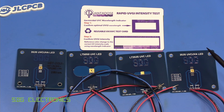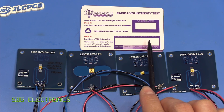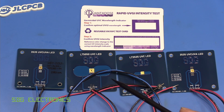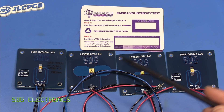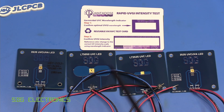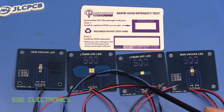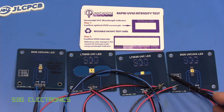Overall, all of these LEDs do actually emit germicidal UVC light, so you could use them for sterilization purposes. The higher current devices produce more UVC light. If you can see the word ultraviolet within three seconds, these LEDs emit more than 300 microwatts per centimetre squared at that distance, which is enough to kill bacteria, germs, and viruses within a very short period of time. However, as we saw, these are only about 2% efficient from electrical power to ultraviolet light — nowhere near as good as a standard discharge tube. So if you're looking to sterilize a wide area, it's probably not the best use of your money. You'd be better off using a standard discharge lamp, which doesn't need the same cooling, can be driven with a standard fluorescent ballast, and gives a lot more light output with a cheaper investment.